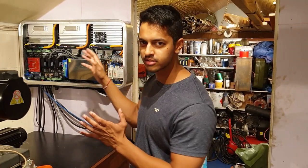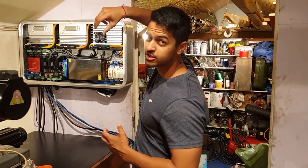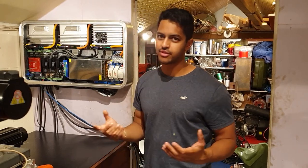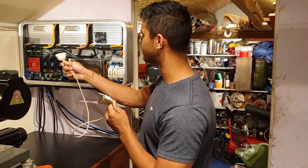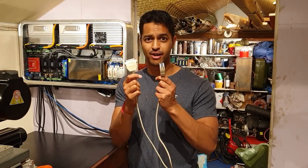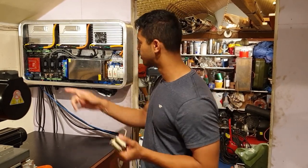I know some communication protocols require a ground for reference. But in this instance, these servo drivers use an internal optocoupler inside them. I think the reason they do that is because you can run them on a differential signal, or you can run them on a single-ended signal, either or. Anyway, I put the scope on it and tried to get everything to work, and I really can't pick up the noise issues, or the actual issues that you're seeing. However, I do know that it isn't a problem with a cheap, crappy cable. If I plug this in between the board and the servo drivers, my problem seems to go away. So I suspect it may well be because of parasitic capacitance in these wires, and the fact that it has a different impedance on these cables is suppressing some of that noise running through.